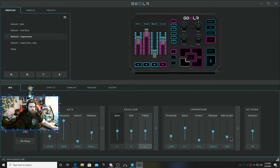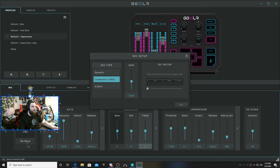If you start getting into quite high levels of makeup gain, it's definitely an indicator that you may have to do your mic setup over again. So you go into system there, and you do your talking into the mic, and you make sure that you're sitting in a good range here. It's a good indicator that you may be in the low range if you're pumping up a bunch of makeup gain, or that you've done compressor settings that are super aggressive. Like if you've got your threshold really low, so you're compressing all the time, and you've got ratio super high,